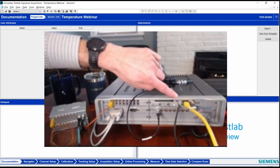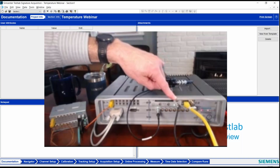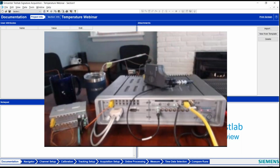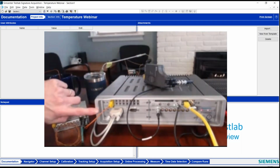So like I mentioned, if I'm going to do temperature measurements using the TCK hardware with the Syscon input, I have to have external power, and there's a special cable that has those little banana plugs you can see there that you have to plug into an external power supply. That's actually something we don't even normally offer on our price list. We can get customers that cable. It's a special order. We just have to know that I want to use external power with these TCK8 modules. It works very nicely then on the built-in CAN, and it saves you from having to use a slot for either the CN4 card like here, or even the T8 card there.